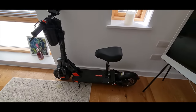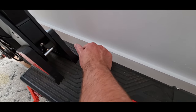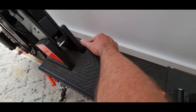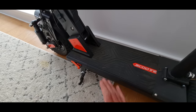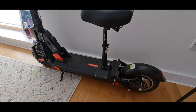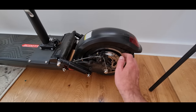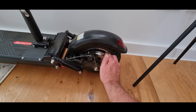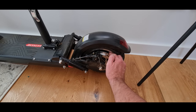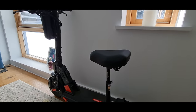So I'd call it a success. It hasn't melted. It's all still working. The speed controller temperature is actually quite warm — you can actually feel it coming through here. This is a metal case, obviously, so that's acting as a bit of a heat sink anyway. So that's really not anything to worry about too much. It's still definitely warm after probably half an hour. So if you're going to do this, treat it with care. Like all this stuff, don't go mad flat out all the time because you will burn this out. This motor will burn out if you continually run up here at full throttle. But other than that, it's absolutely transformed it.